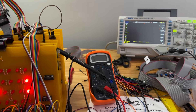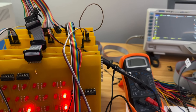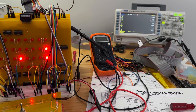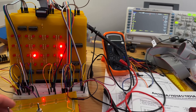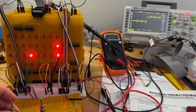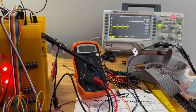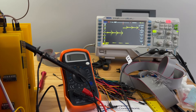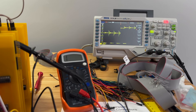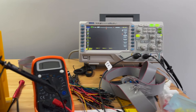After extensive debugging, I think I've narrowed it down to the connections between the address latch board and the memory board. With the oscilloscope connected to the write-out pin of the address latch board, we can see that it spikes when the deposit switch is toggled, which seems correct. However, if we connect the oscilloscope to the memory-in pin of the memory board, the spike no longer occurs. This is very strange — it's as if there is a short causing the spike to disappear.